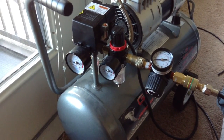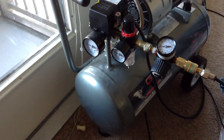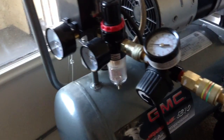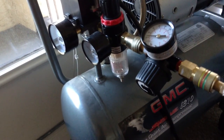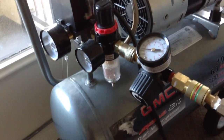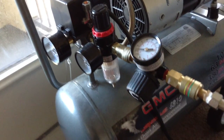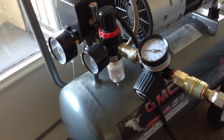I do not run this prop on a lot of air pressure. Typically around 20 psi is sufficient for the moving parts. As you can see here, water gets filtered out of the air to keep it from corroding different components. It also contains a dust filter, which helps filter out dust and dirt from the air.